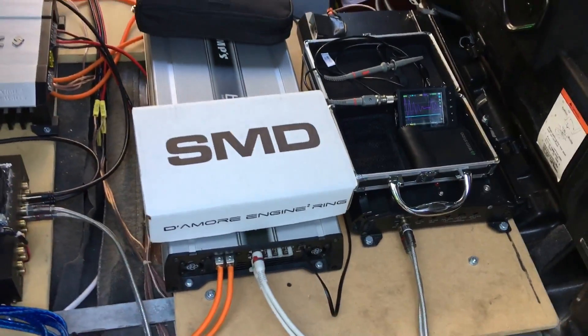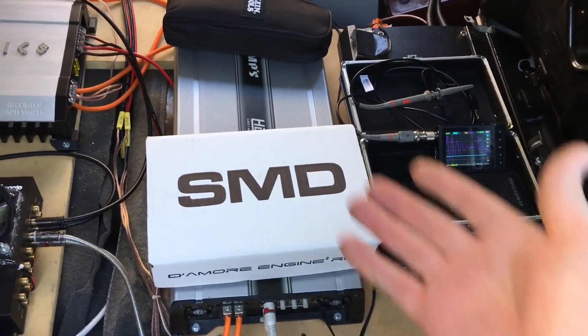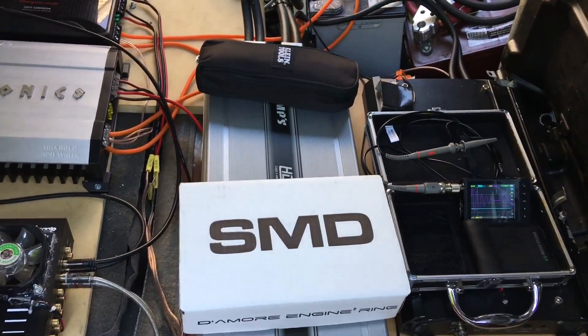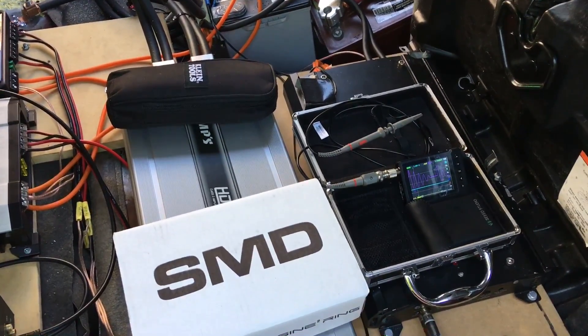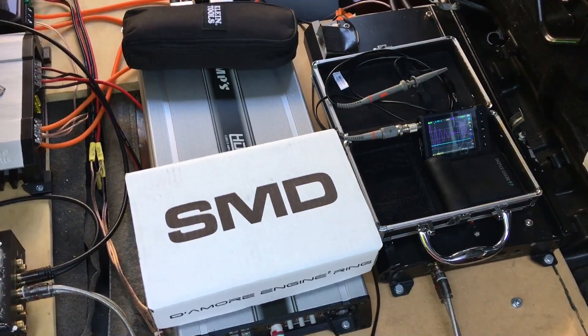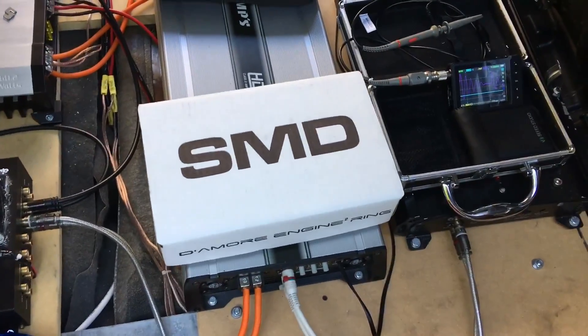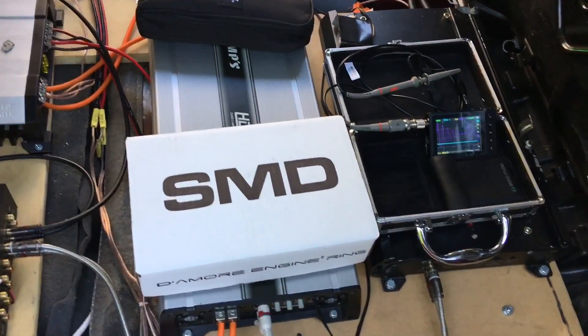When I tune with my DD1, in conjunction I use my DMM. You're always going to use the little equation they have for finding out the unloaded AC voltage — I do that just to kind of eyeball it because I know my amps pretty well. But this distortion detect light is no joke. It is the real deal.